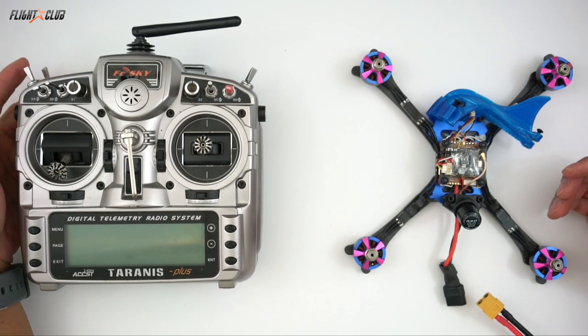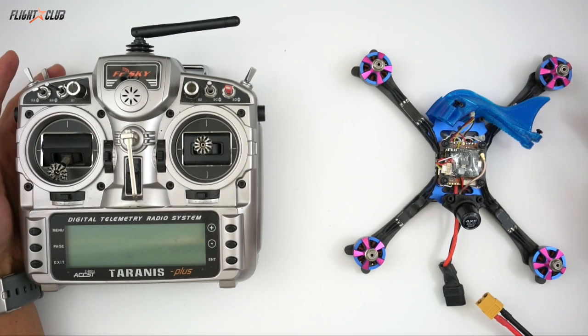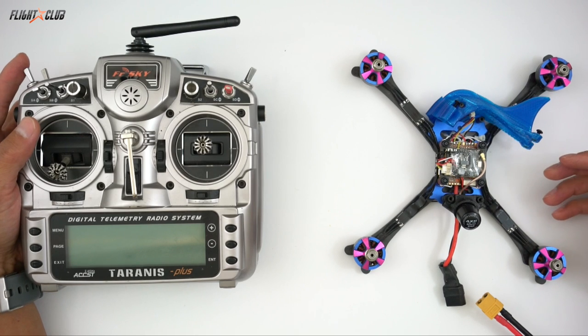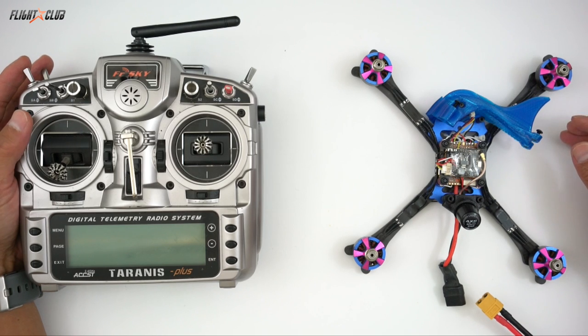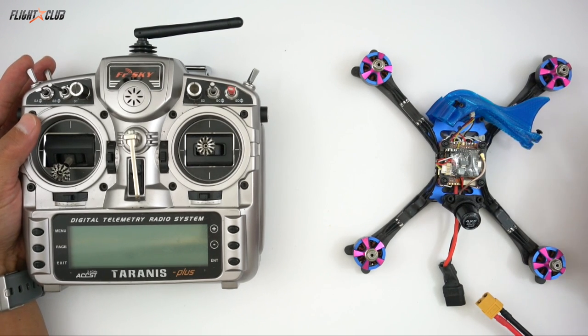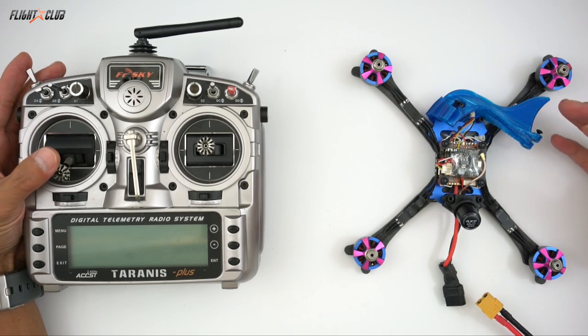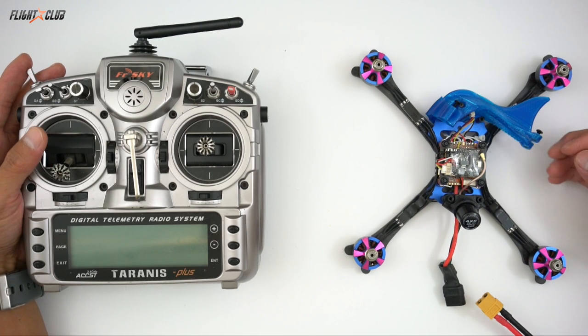The RealPit is a really cool little feature to have on your quad because it can save your VTX from burning up. Say you're sitting on the start line and you don't want your VTX to overheat — just turn it off. Or in a team race if you crash, you can turn off your VTX so it doesn't mess with anyone else's signal. In a regular race, if you crash and you don't want your VTX to burn up, just turn it off until you retrieve your quad. I hope you found this video helpful — put questions in the comments or on my website and I'll answer them. Thanks for watching and please subscribe.